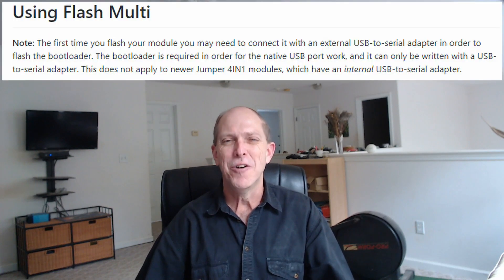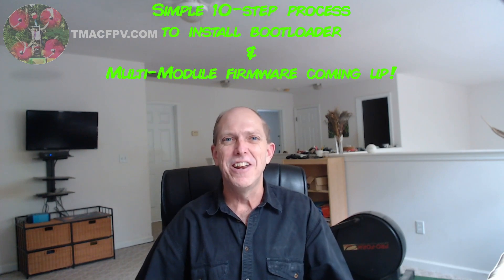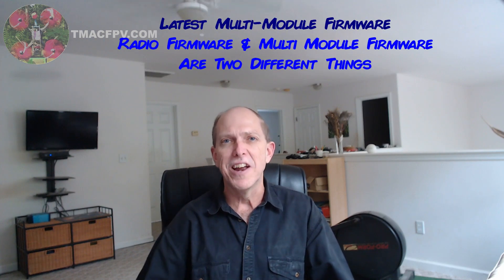What really convinced me was that OpenTX is going to officially support firmware updates for the T16, most probably beginning with OpenTX version 2.3.2. However, the T16s Jumper has shipped don't contain the bootloader required to update with OpenTX firmware, so today I'm going to demonstrate how to install it and update my own T16 with the latest firmware.